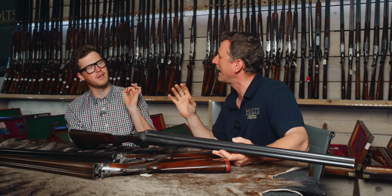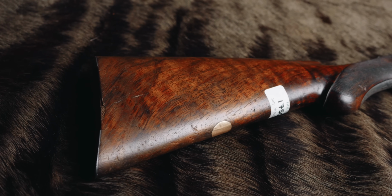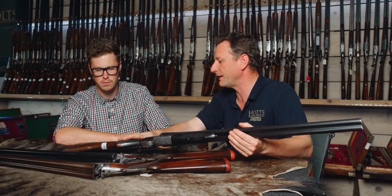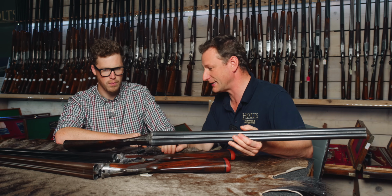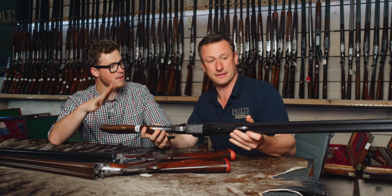I wanted to see... Sympathetic restoration. It's exactly that. I wanted to see some slight history left. So this could do with some of these marks and dents being knocked out to allow this colour and this figuring that is inherent there to come out. Put a decent finish back on the wood. Exactly. Fill the pores. Make it gleam a bit.